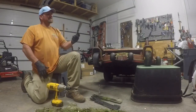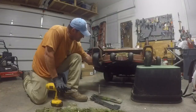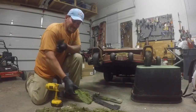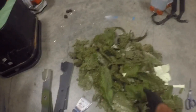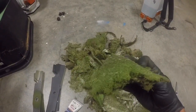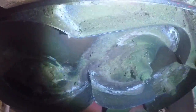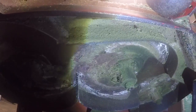The second thing is cleaning under the deck, and this is kind of simple. There's a little scraper tool here and you basically crawl under and scrape it off. This is about 25 cuts worth — you can see this huge pile we've got here. That buildup disrupts the airflow under the deck. These decks are made a certain way — the rounded shape is where the blade spins to create a twirling effect that shoots the grass out. When you have big chunks of grass stuck up under there, it disrupts that flow.